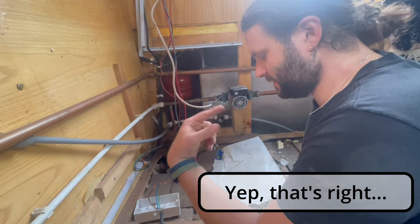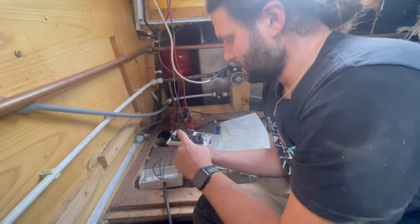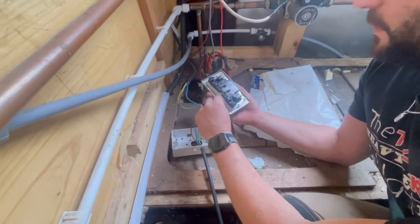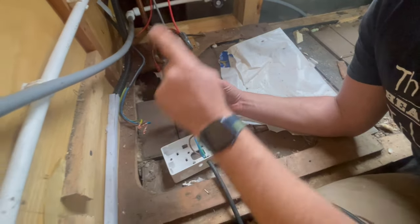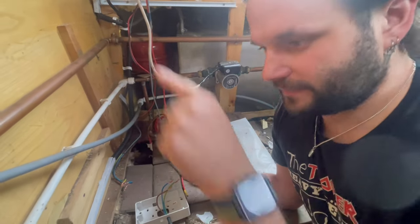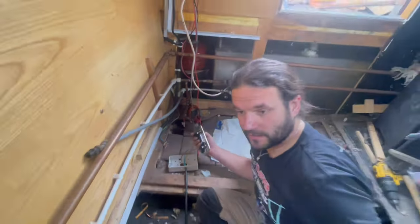There's a thing to remember and I always forget the thing to remember. But then they all go into the back of these - your three pin double socket - and they all go in together. So blue to blue goes into the neutral, the brown to brown goes into the live, and the earth goes into one of the earths. That continues the circuit across the sockets and then down the cable. All of these sockets are in series, so as long as they're secure, safe, and not exposed cables, we can turn the power back on.